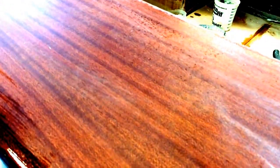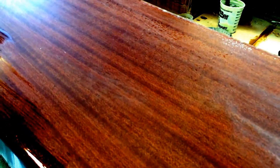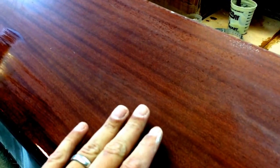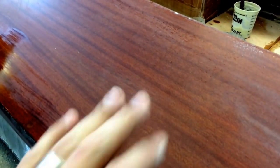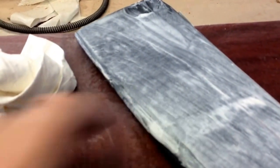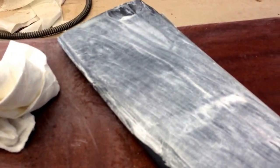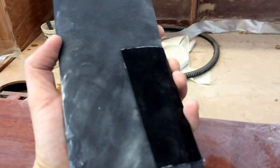What I'm doing now is I am starting the process of wet sanding this epoxy, the purpose of which is to create a final faired surface on which varnish will be applied. The process I'm using — this is actually a 320 grit wet-dry sandpaper that I have over a cardboard, just a folded up piece of cardboard, and it's just duct taped on the back. It's a silly looking contrivance, but it works.